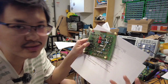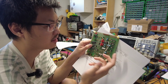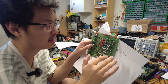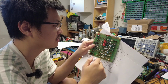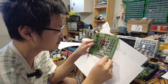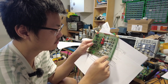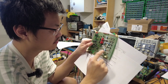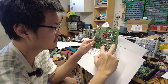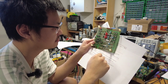If you do have a 1210, some of the guys recommended upgrading it to a 2074. It's a better op amp. These caps are very great, WIMA MKS4, so we use them in the amps. It's a calibration spot, so I'm not going to change that. Some of these Alco capacitors are going to fail at some point.